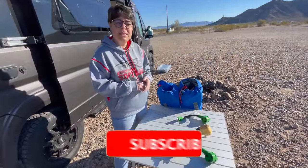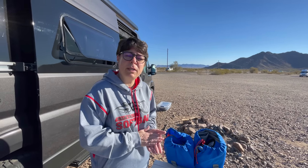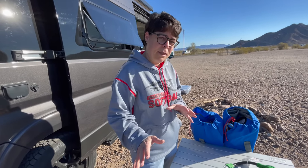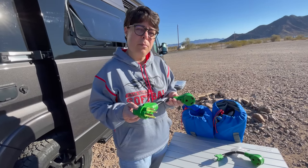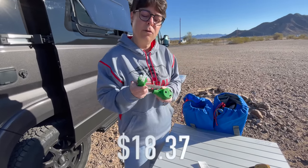One of the things that you'll learn is that lots of places that have electrical hookups have different amperages — sometimes 15, 20, 30, or 50. Our van, the Travato, is a 30-amp van. So if we pull up somewhere and they have something other than 30 amp, we need an adapter. We have one to convert from 30 to 50, and one to convert 30 to 15, which is like a normal house plug.